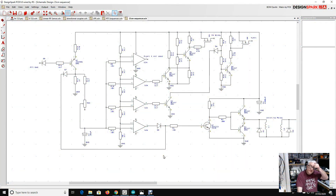To finish off the sequencer topic — this is a conventional analog sequencer I built for a 23 centimeter amplifier a few years ago. The input gets grounded, which passes power to a capacitor which charges up. As the capacitor voltage ramps up, that ramping voltage is fed to four comparators, each with a different potential set by a cascading potential divider. So as the voltage ramps up, this switch turns on, then this, then this, then this. When you release the PTT the capacitor discharges and each switch releases in reverse order.